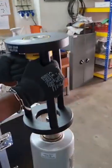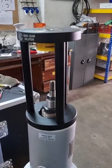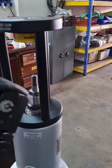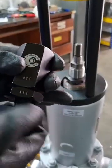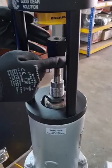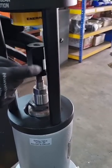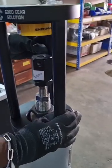So once we have placed the column bracket on top, we can then go on to connect the coupling. Since this is an M16 thread, we can use the M16 coupling. So we just remove the M8, and then we screw it in. Make sure there's a minimum of 5 turns when it's screwed in. There you go. Make sure it's secure.